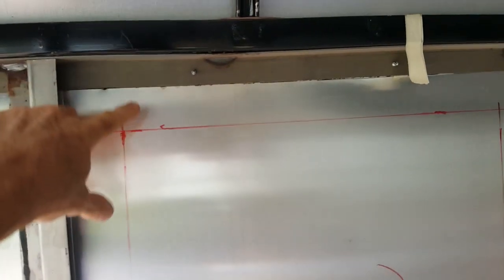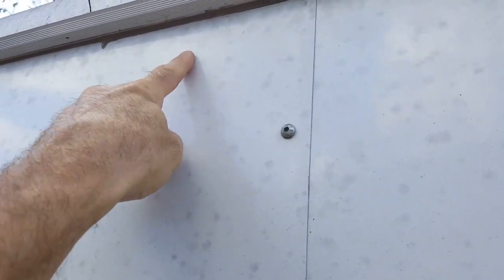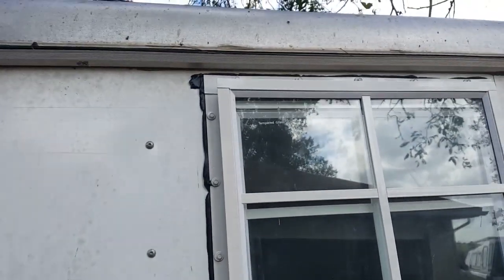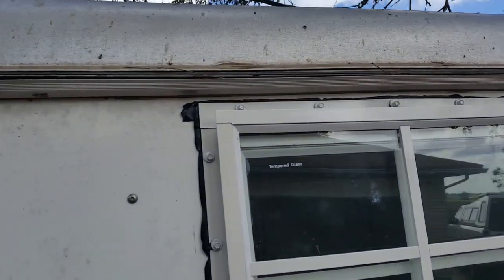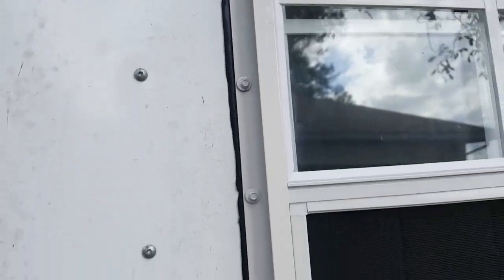I've got to show you on the outside why they're positioned where they are. I've positioned them three inches from the top rail and pretty evenly spaced between the studs. On the outside there's a rain gutter, so the trim and everything will be about an inch and a half from it. The 18 by 27 dimension does not include the mounting flange and trim — on this one the trim got pretty close to the rain gutter, about a half inch away. The trim sticks out further than the 18 by 27.